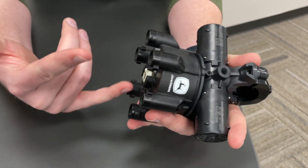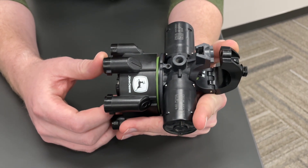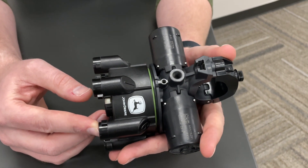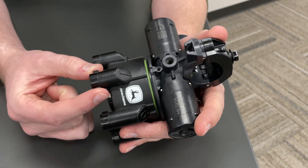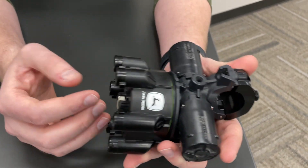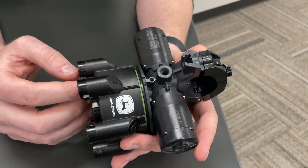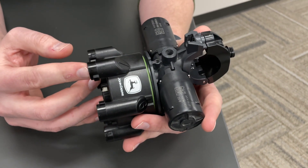Another use case of running two tips simultaneously is high rate fertilizer with a prescription. For example, running a higher rate in the center of the pivot and a lower rate in the pivot corners to save fertilizer costs. Instead of a single size 20 tip in Combined A plus B mode, you could run two smaller tips like two tens, which gives flexibility when the prescription changes and the rate varies greatly across the field. This has worked really well for variable rate fertilizer applications.